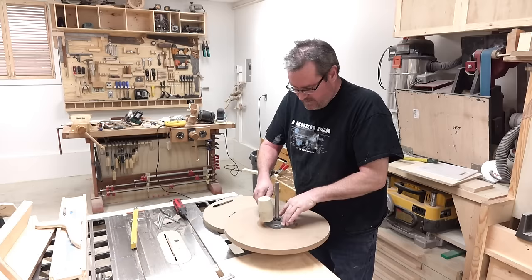I'm using these because, first of all, I have them, and second of all, they're nice and straight, and they're dry, and they're not going to twist up on me and throw everything out of alignment, which is important for this. I picked out three. Those are all that I'm willing to spare for this. Normally, if this machine was going to be something that I would keep, I would build all these parts from steel angle, just to make sure that it stayed in alignment. So what I'm doing now is I'm checking to see which ones of the three are the straightest.